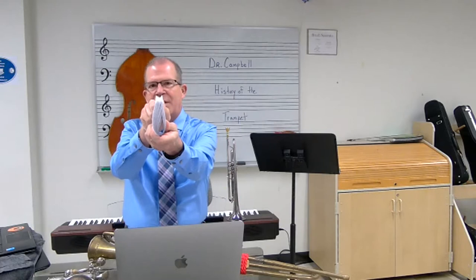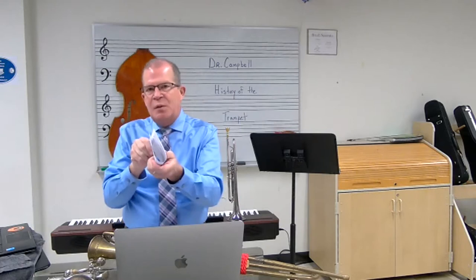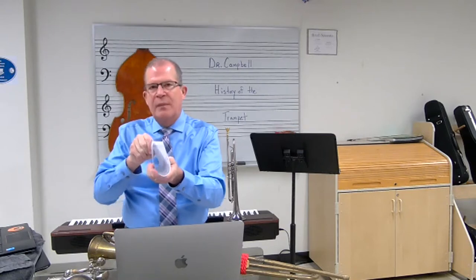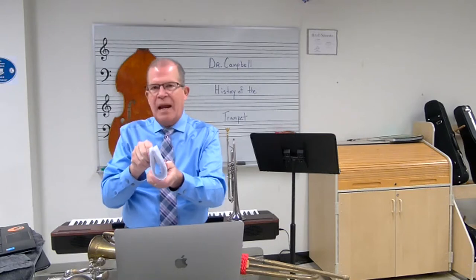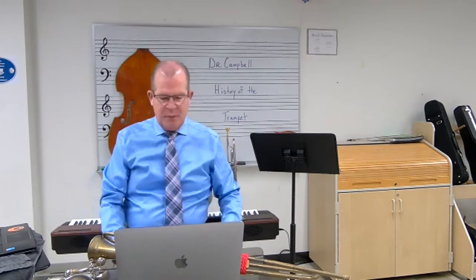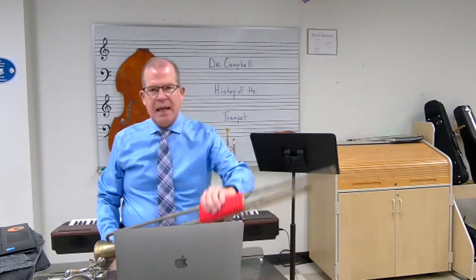And from there, you have to push it onto a mandrel, which is in the form of a bell, and start hammering the bell to spread out the brass so that it eventually forms the shape of a bell. That took a whole day.